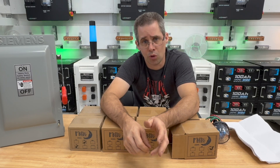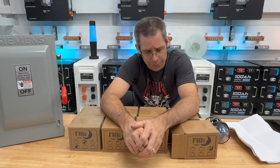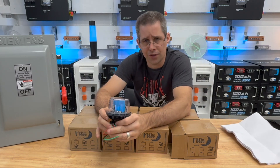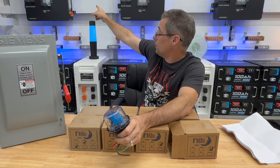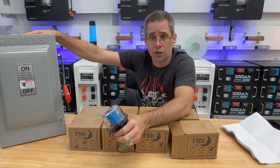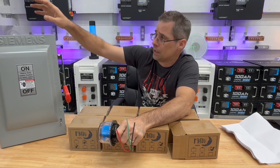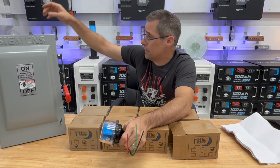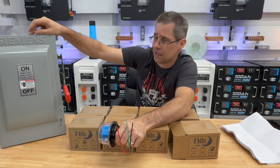For the DC side, I'm going to have five strings come in, one for each inverter. I'm only going to use a single MPPT controller on each one of the inverters and I'm well under the maximum wattage for them. They're good for 600 volts DC. Here's one of my solar disconnects — this is going to be from my primary inverter, which will have the most solar panels sending power to it. I'm going to have about 30 to 32 amps flowing to that inverter.